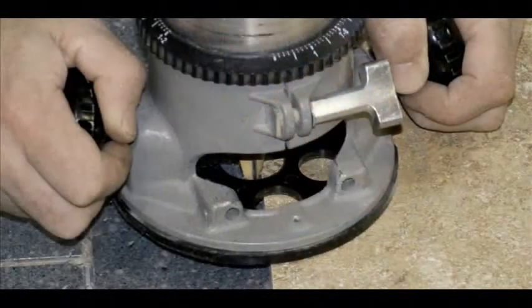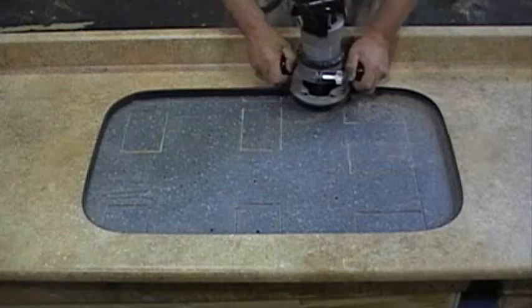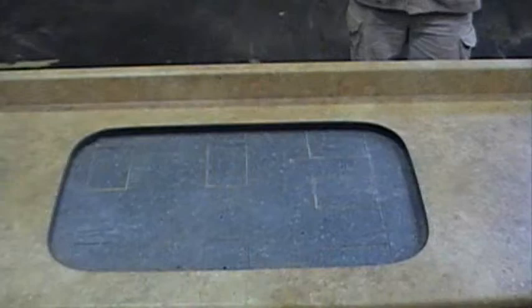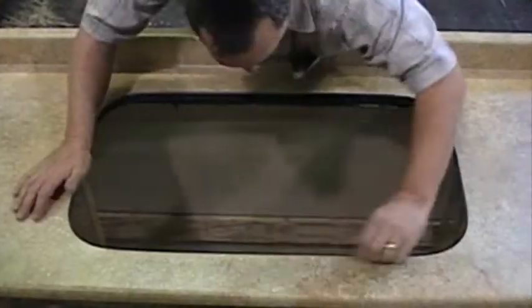Use a slight angled router bit to route the laminate from the inside of the ring. Hand sand the ring using up to 600 grit sandpaper. Polish with automotive cutting compound if desired.